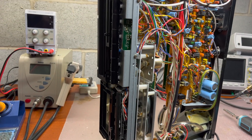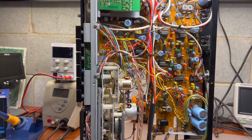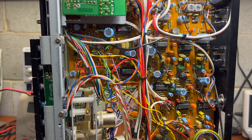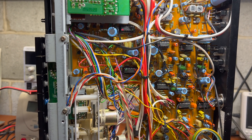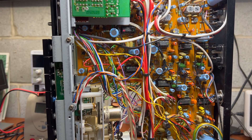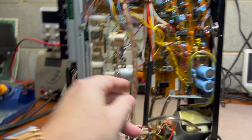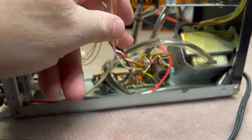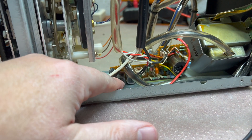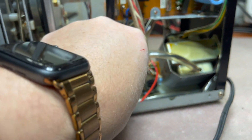Here I'm opening the 482Z and I found a couple of interesting things I haven't seen before. You might see there are eight Dolby chips here - four here and four here - to make sure it can record and play at the same time. It's a three-head deck and it has tape monitoring. That's the head we're interested in. The record and erase head goes to this small board here, which is a bias generator. So it has filtering coils and isolating capacitors, and here is the generator itself. Interesting design - I've never seen this before.